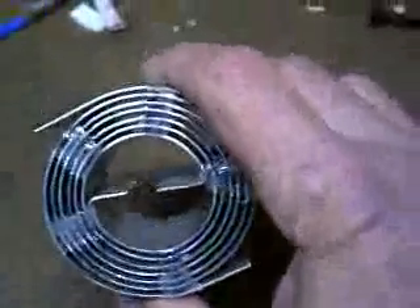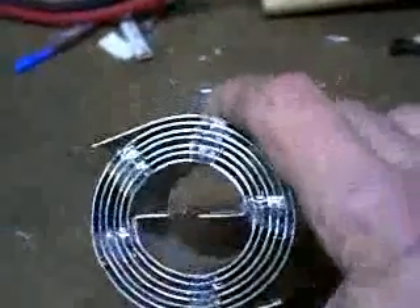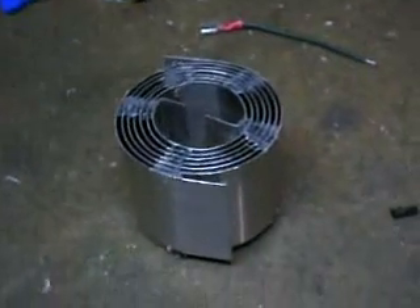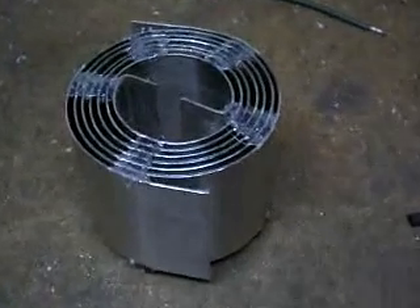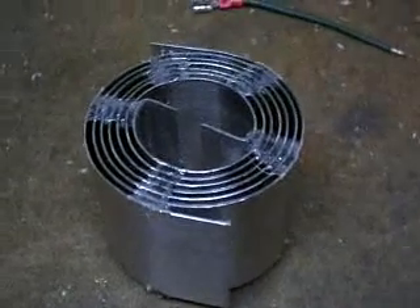You can also see the adhesive that I've applied. It is just at the tips of the nylon spacers — it's Goop Marine Adhesive, and it sticks extremely well. I'm going to put it in the electrolyzer tank with just distilled water, and I'm going to measure the DC resistance and see if it was an anomaly with the capacitance value that I got earlier.